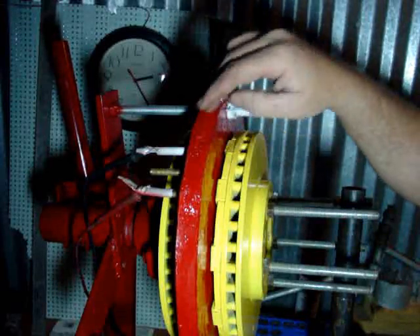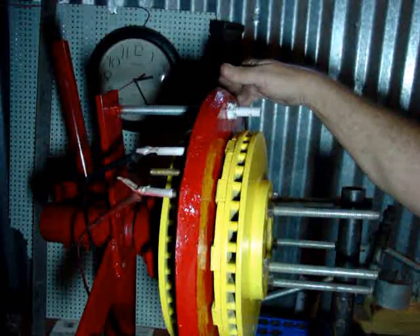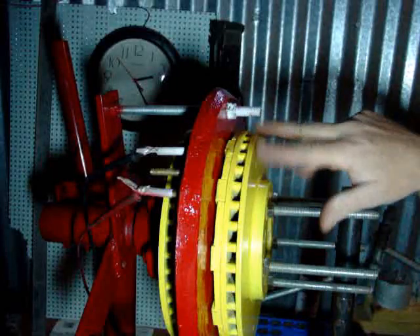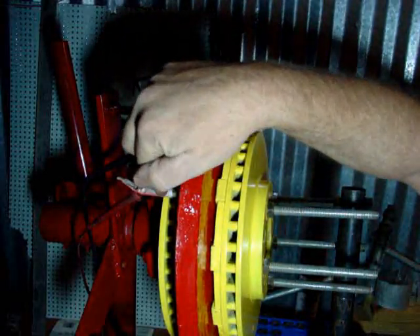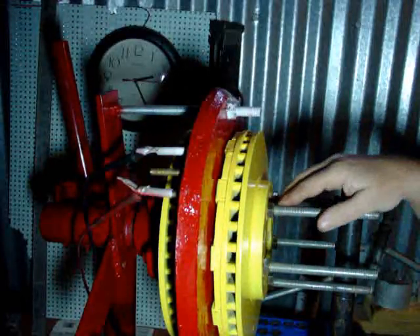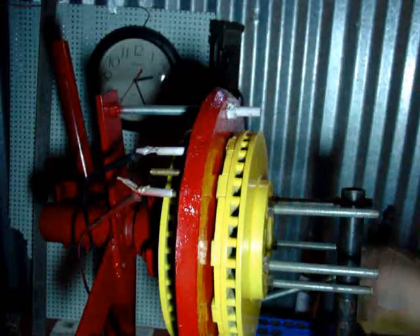The south magnet is leaving the coil, so the negative flux is decreasing. This is the third phase — it's going through this set backwards around all the way to the start of the third phase, shorted out, and comes back through the first phase. That magnet is increasing in north flux — positive flux. So both sets of coils have current going in the right direction. It's wired so it goes in here and comes out here, then goes in here and comes out here — two sets of magnets and two sets of coils generating at the same time, terminated in series. At 60 RPM we're showing six volts — three volts on each set of coils in series.